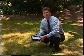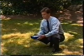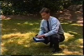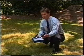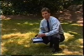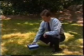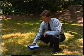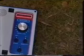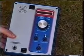The Model 902 receiver also works in the null method. Simply take your receiver, rotate it onto its back, and increase your signal level. Now when we walk across, we'll get signal everywhere, but we'll get a quick cutout, which is the null, directly over the pipe. For example, full signal to the left, full to the right, dead spot. That's where the pipe is. That's the null method.